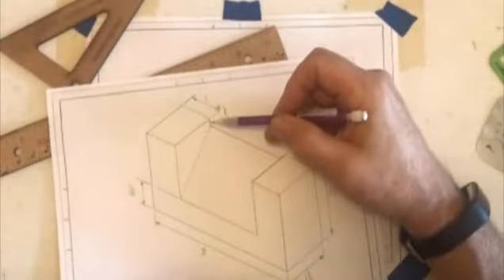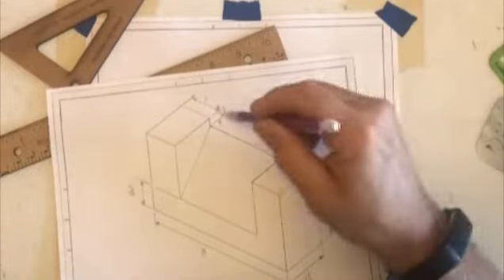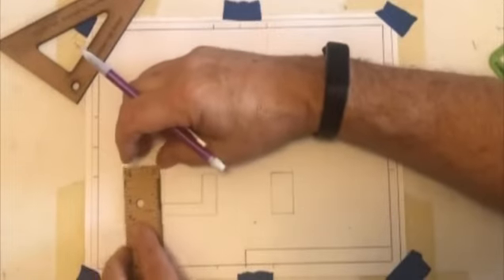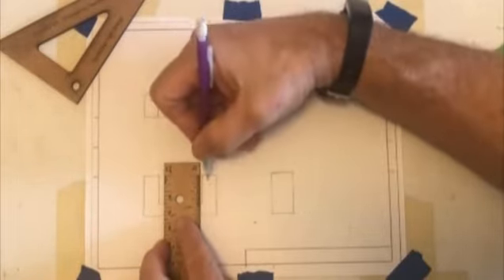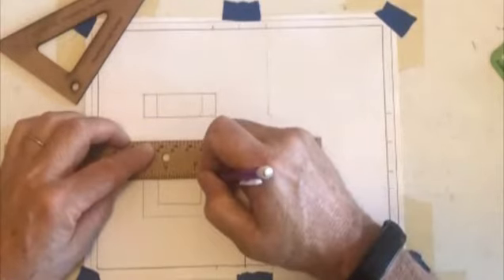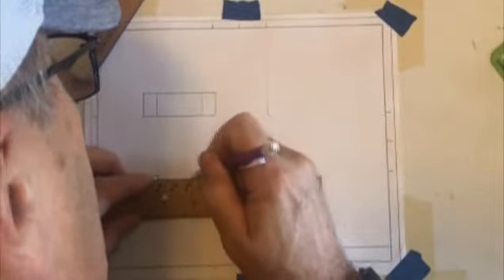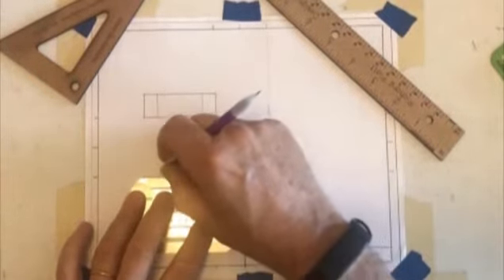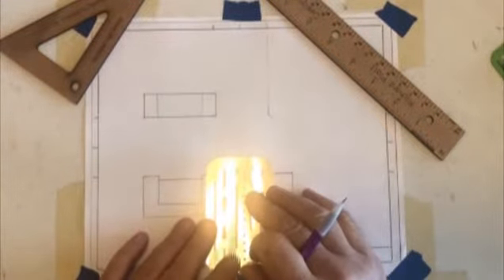Now, if we notice this part that's kind of cut out here — it's a quarter of an inch down. So in half scale, half of a quarter inch would be one-eighth of an inch. Let's flip our ruler around and find that mark of one-eighth of an inch. I'll come across and do the same thing on the other side. I'm going to draft that line in, going pretty heavy to make it a defined object line. Yes, that looks nice. If you don't have an eraser shield, you can pick them up at Staples, Office Depot, Michaels, or Amazon. Any typical drafting kit will have something like this.